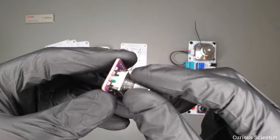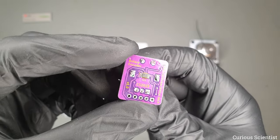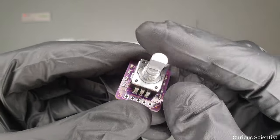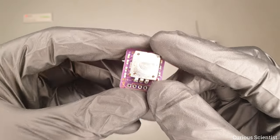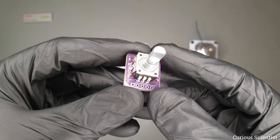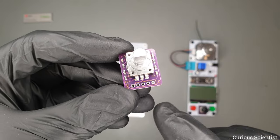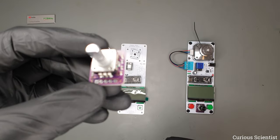And then this is one of the rotary encoder modules that I have recently designed and showed on my channel. This is a debounced module, but what I use it for is to select things or set certain values on the display and so on. So this is to give some values for the stepper motor. And I designed this board in a way that you don't have to use this with this platform.